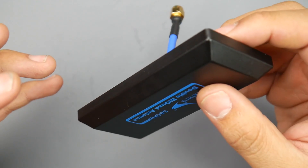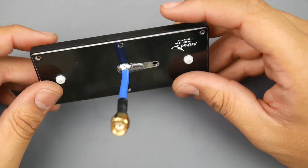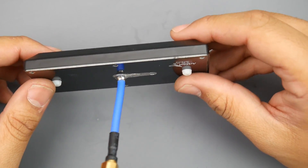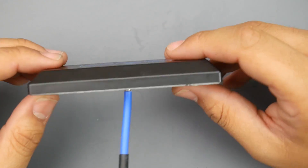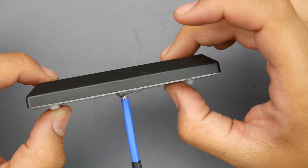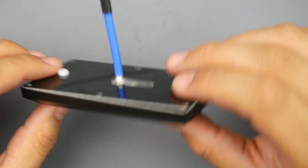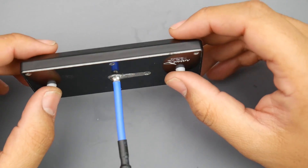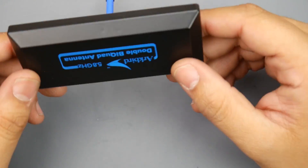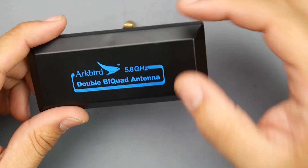Overall I think it's capable of a lot more, but it's much more sensitive and you have to get the direction just right. I believe you can get possibly over eight kilometers of range with this, but currently without an antenna tracking system it's difficult to get past four kilometers — even past three kilometers it just gets really sensitive and I had to keep moving it. I did try both orientations and found one way to be better. I'll be retesting this. If I was using my ground station to fly, I could not have relied on just this as my patch antenna for long range. I'm not saying it's bad — it just has its own use and I believe it's meant for antenna tracking systems.